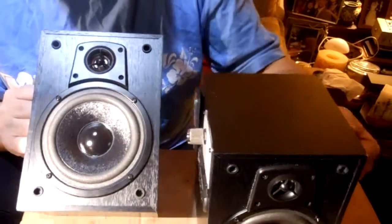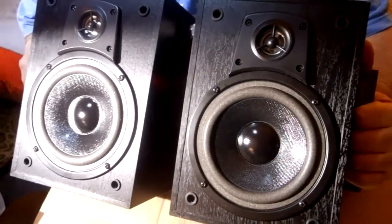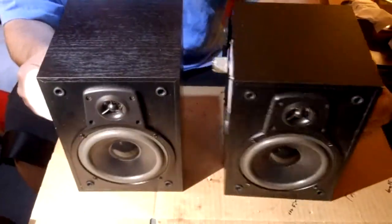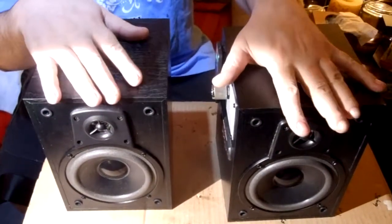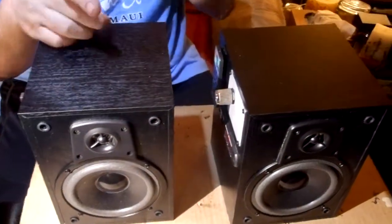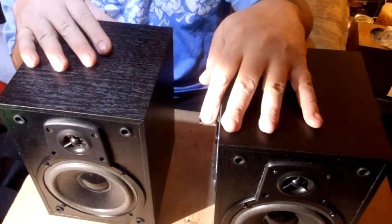So yeah, they are Walmart house brand biaxial. They're like $49 retail, and they have a 2.2 uF capacitor inline on the tweeter. So I ordered some two-way crossovers, small ones rated at 60 watts that I've used before. They're good crossovers. You can get a pair of them for $6. I ordered those and they didn't arrive. They were supposed to be here a couple weeks ago. So I had to file a claim, and I got another set of those coming.